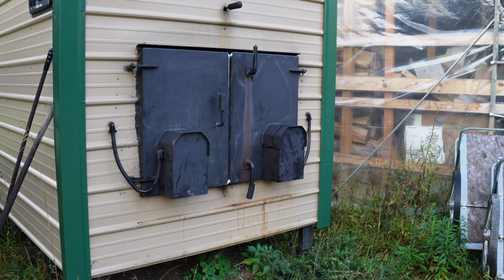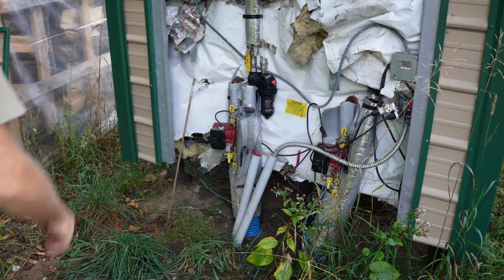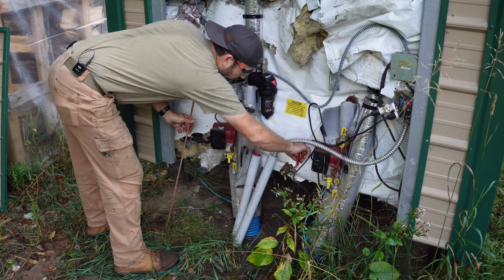So apparently I stopped the camera when I started putting in the door seals and started the camera when I was completed, which is why we're staring at the completed doors. Anyway, it's not very complicated. I just put a very thin bead of the black high temp RTV in the back edge of the door seal channel, and then feed the line in there. Just don't stretch out the line. Let it be kind of thick and bushy when you're pushing it into the channel. I still had almost 2 feet left over when I was done, so plenty of rope there to do the whole thing.